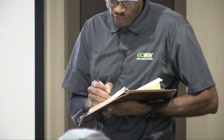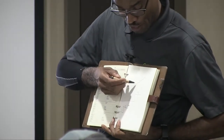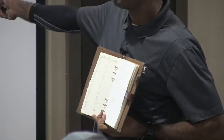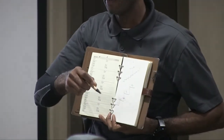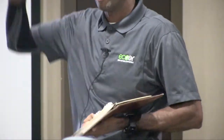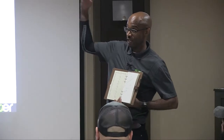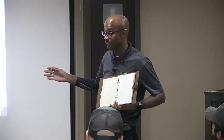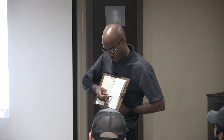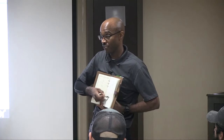With our unit, we've got 40 different stages, so a lot more stages. If my load condition is here, my unit is going to be running here, not all the way up here. So I don't need as huge an outdoor coil as they do, because my compressor is not pumping as hard. The reason you need the big coil is because your head pressure gets high. If the compressor is running at a much higher frequency, your pressures are going to be higher and you need to reject that heat somehow. The way you reject that heat is with a larger coil. But if your compressor isn't running as high, and I have more stages so I can run here, then my coil doesn't have to be as big to reject the same heat.